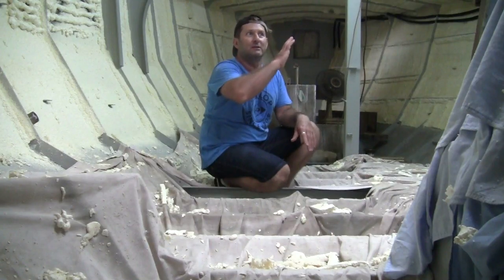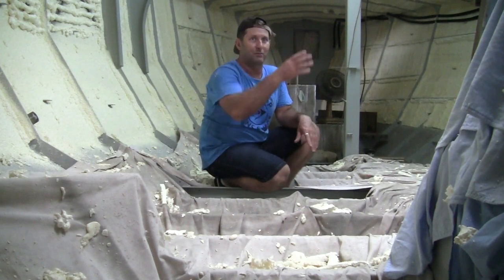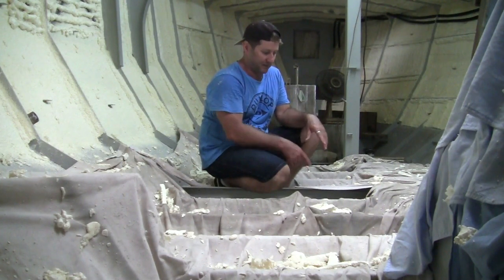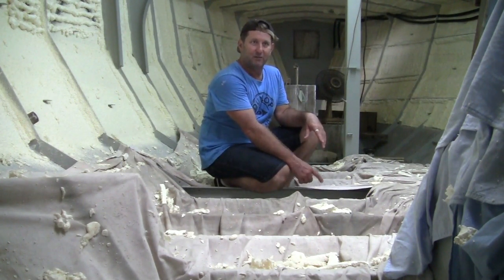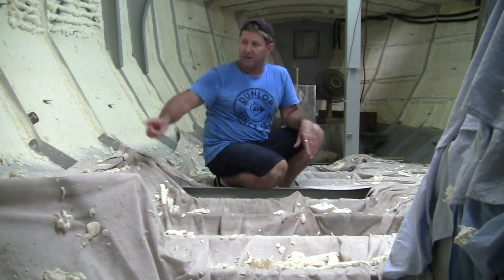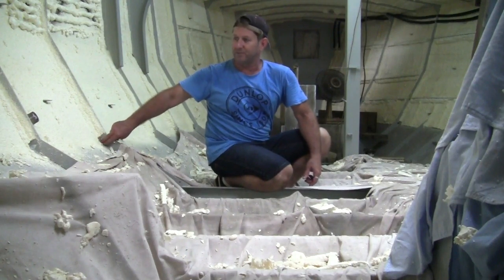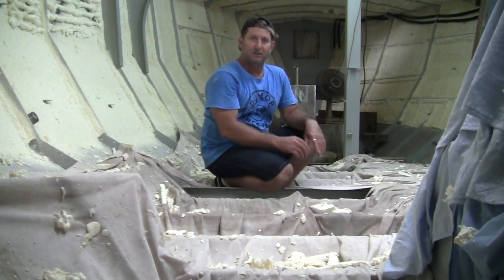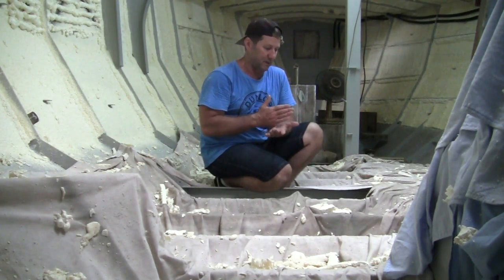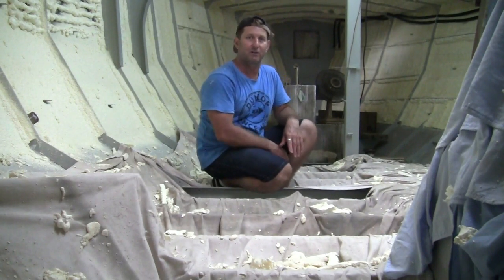But then I will continue on cleaning the foam off the beams for the remaining bits of the boat, and then I'll be doing the epoxy fairing compound coving to all of the hull floors and beams from the end of the insulation all the way down to protect basically underneath the beams and hull floors where they touch the plate, so that there will never be a water issue causing corrosion there.